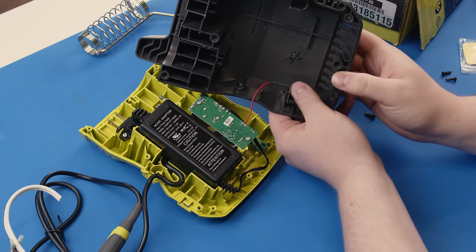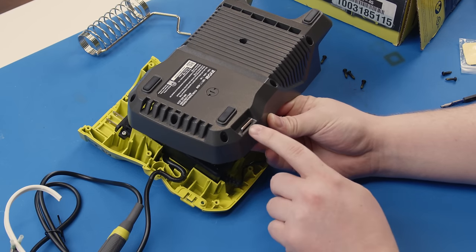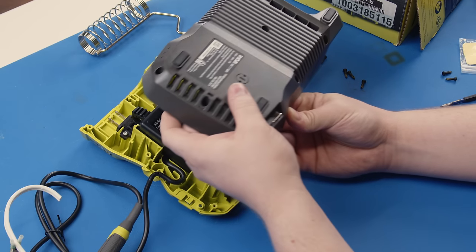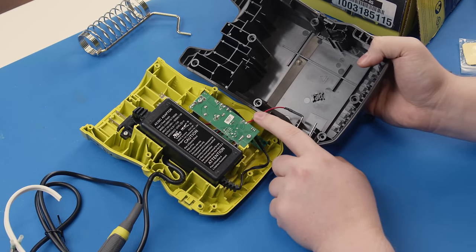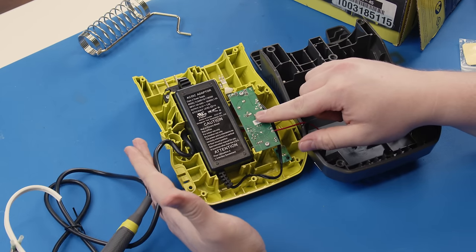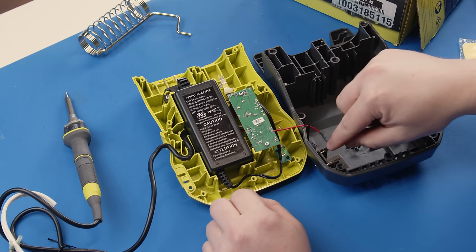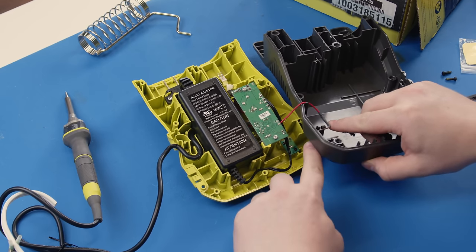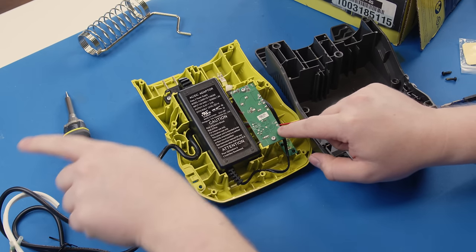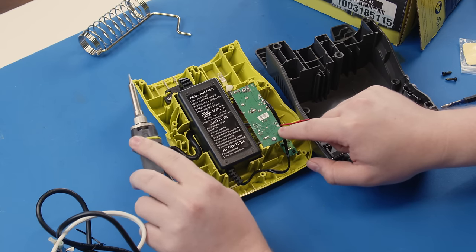Again, because I hadn't actually read the verbiage on the box. The bail protrudes over here, and it looks like some sort of, I don't know, belt loop. Something like that. It's not labeled. It's not clear what it's for, but it is actually wired up to something. And I traced this, and it turns out that it goes into the cable that goes down to the iron. And I realized that's the ESD strap. This bail is here on the outside, so you can clip to it and then clip that into your anti-static ground system. And then it passes all the way through to the iron so that the iron does not potentially static shock the devices you're working on. That's pretty clever.